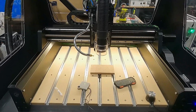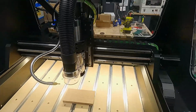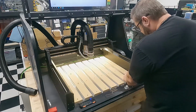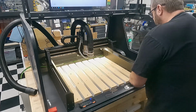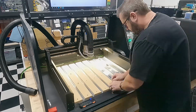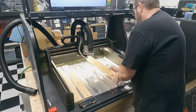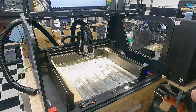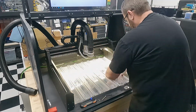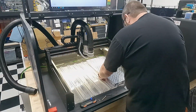But I bought an HDM to mill aluminum, and for that reason, a fixture table is in order. So if you want to go that extra mile, like I did, the next step is to go to Saunders Machine Works and order their aluminum fixture plates. And what you see here is what we're doing. In order to install that, you need to remove all of your wooden slats. Now, this version that's available at Saunders Machine Works will mount directly into the T-slots.